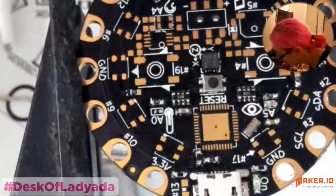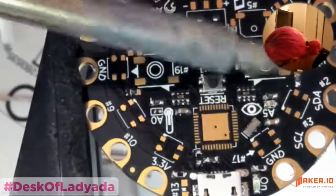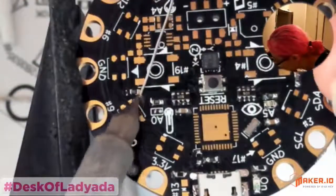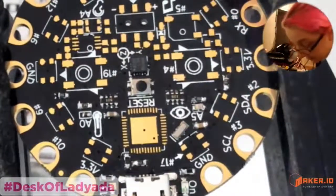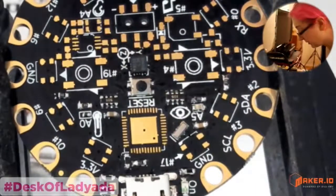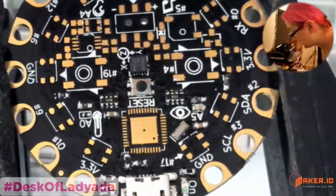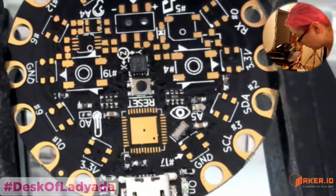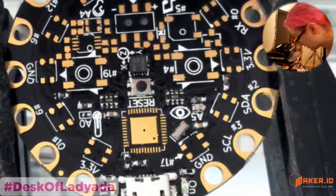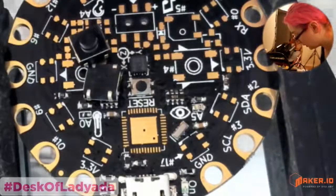It only has optional pull ups. So it's one of the things about the AVR platform. These two components are required. If I ever revised this design to use a different chipset, I might be able to get rid of those resistors. And every component does count. It's not even the cost of the component, but placing the component, and that component can cause problems, it can be wrong. So anything you can do to get rid of components will make your life easier. You really do want to minimize them.